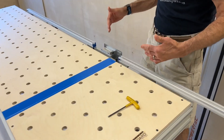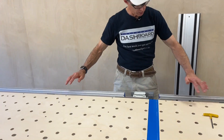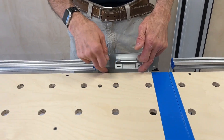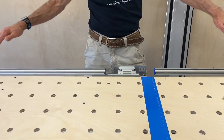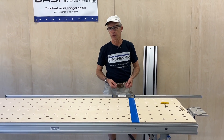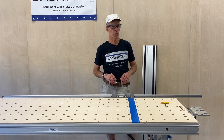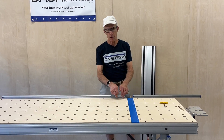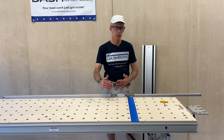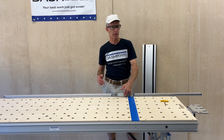What we're going to do is make sure that all three of these surfaces — the short fence, long fence, and guide rail bracket base plate — are in the same line. The base plate has what we call the raised position, usable only on the Dashboard table, where it becomes part of the fence to support shorter work pieces closer to the line of the cut so they won't pivot because they are backed up by this.